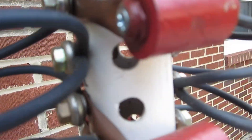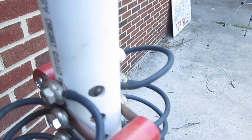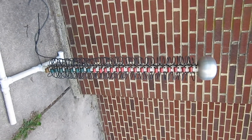Let's take a look at the spark gaps first. I drilled holes here so I could fiddle with the spark gaps, and there's a bunch of spark gaps in the middle. Let's take off the top and look down the center — there are just rows and rows of spark gaps all the way down. I had to tweak all of them so they're about the same distance apart and get this thing all tuned up. It's like an instrument — it all has to be tuned so it operates properly.